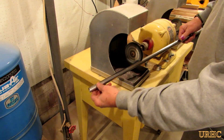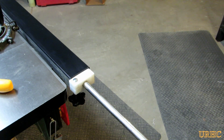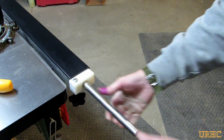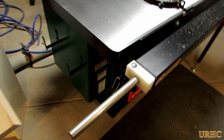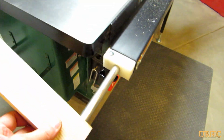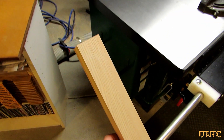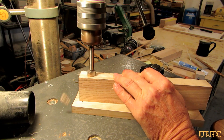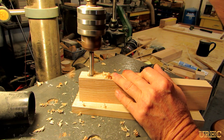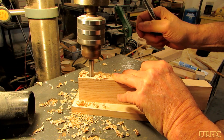This is a real stiff, rigid piece of tubing — about a sixteenth-of-an-inch wall — so you could even use a solid rod of aluminum or something similar. With it cleaned up I slid it in and it's a real tight fit; I didn't want it to wiggle around. I then took a block of ash left over from another project, cut it to approximately the size I wanted, and drilled a three-quarter-inch hole to match the outer diameter of that tubing.